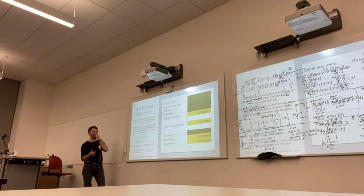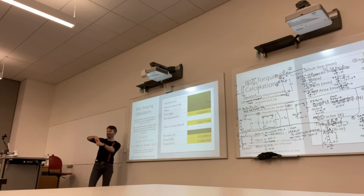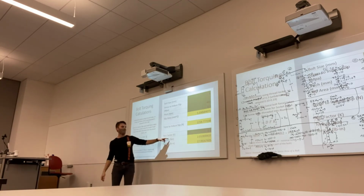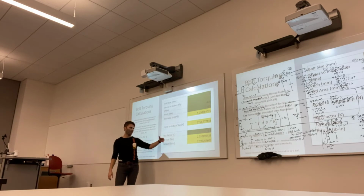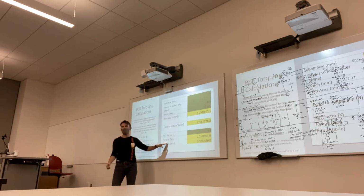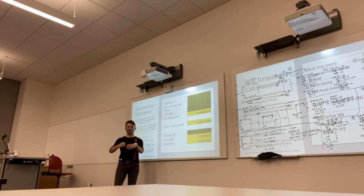If you have a bolt that's lubricated, the threads from the bolt will actually grip the threads of the female end it's going into, so it will hold a little bit longer. So you have a little correction factor there to compensate for that. And from there, you can calculate from all these previous equations for your torque wrench what torque you need to put that at in order to get the maximum torque out of it without stripping the bolts.